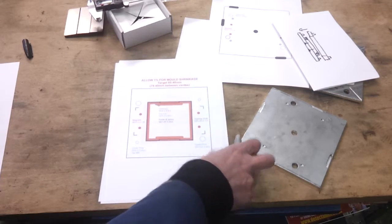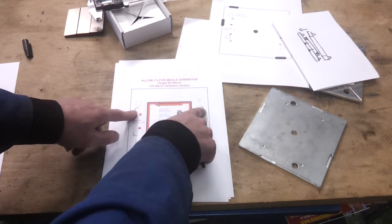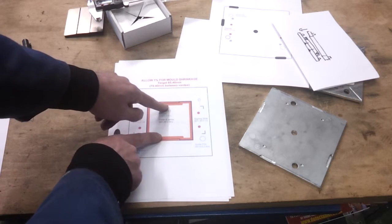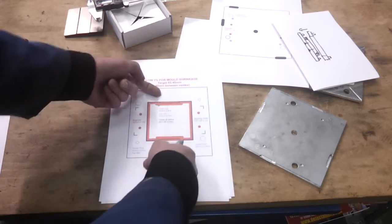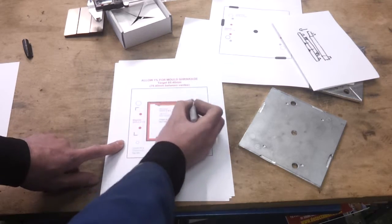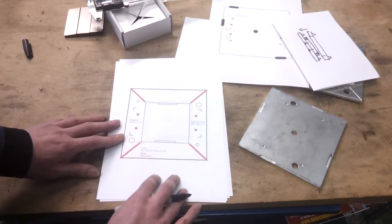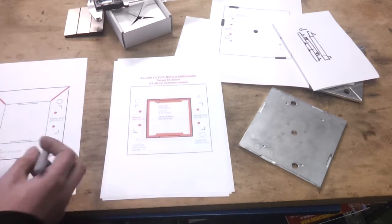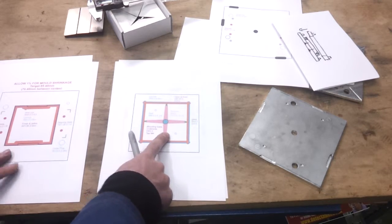The complicated part is I'm going to have to come in here in sections to pocket all of this — this will be the outside of the frame. I need to put a few reference marks on here so I can re-reference it, because I'll probably have to come back in. I need 79.4mm across the little vent slots and 85.4mm on the outside diameter, so I'll probably cut it to about 85.9mm and start slightly small, then open it up with fine passes. I'll do the base plate and centre core first and then take it from there.